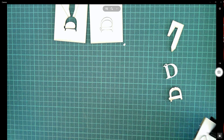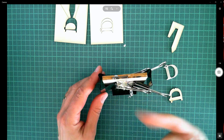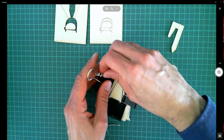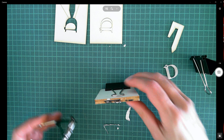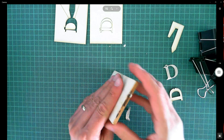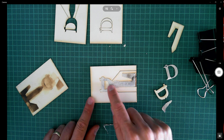I've just finished pewter casting. Here's the mold now with the bulldog clips and the pewter inside — you can perhaps just see the pewter inside here. It's leaked a bit outside as well — there's pewter trickling down the side by the bulldog clips. We don't really want that to happen but sometimes it does. Let me try and open this up and see what we have. This has been about 10 minutes. You can feel it's still quite hot but not so hot that it's a problem to touch. If I pull this off — there we go — there's my D! You can see that's pretty much an exact copy.